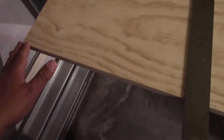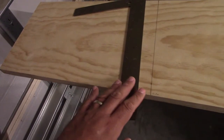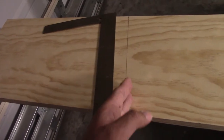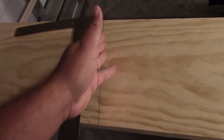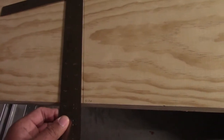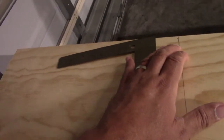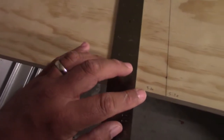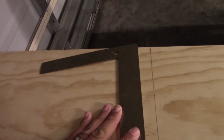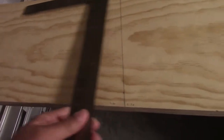Since I've already pre-measured my board, just make sure you run your measurement from the bottom to the top and line it up well. The sideboard is going to be cut at an angle, so make sure you use your square. Once you measure 15 and a quarter inches and 16 and a quarter inches, put a dot at each mark, take your square, and line it from dot to dot to get your angle line — this applies to both sides of the screech owl house.